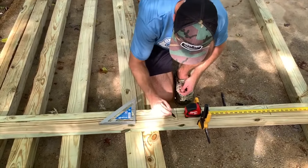And then we're putting it in place so that the overlap edge goes on top of the sheet we installed previously and that cut section is towards the back corner. Now, this LP SmartSide installation is gonna go so much smoother if you planned out your stud spacing so that every underlap and overlap edge is gonna land exactly where it needs to in the center of a stud.